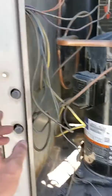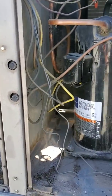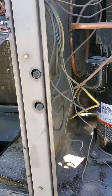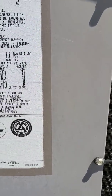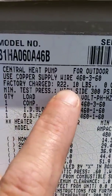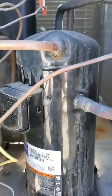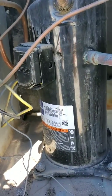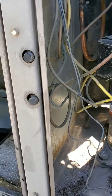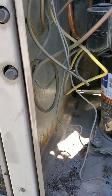That's pretty much what I would do - check your pressures. This is your high and your low - red and blue - just check your pressures and make sure they look fine. You also need to know the outdoor temp. Make sure what refrigerant this is - this is R22. If you notice right there, this unit takes 10 pounds of R22. On your gauges you would check R22 - remember your pressures are going to be your low side about 65, your high side about 250. You want a 40-degree evap temp on there. So wherever that 65 line is on the gauge, you're going to see 40 - you've got to have a 40-degree evap temp.